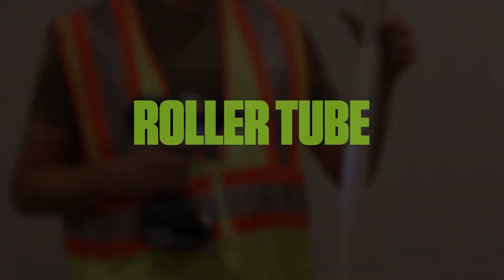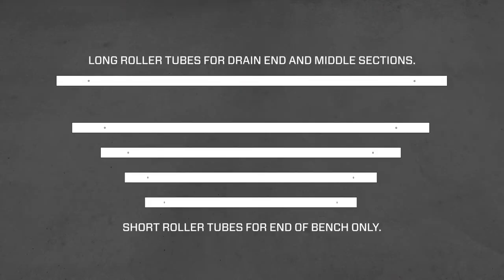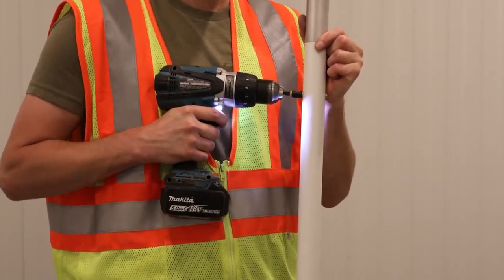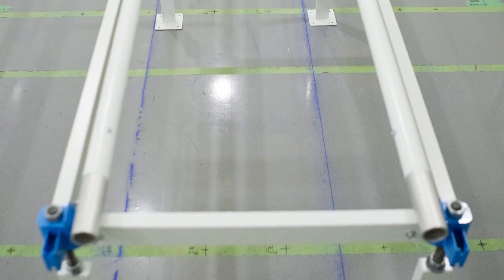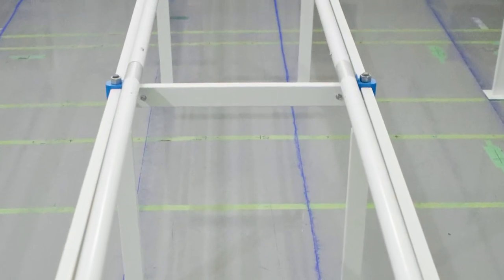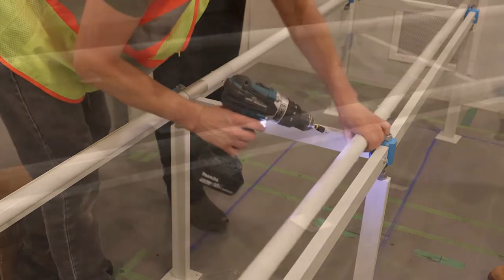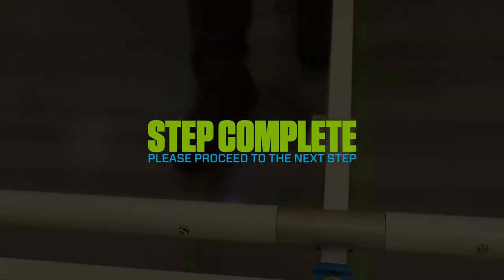Step 6: Roller tube assembly. There are two types of roller tubes: short and long. Separate the short tubes from the long tubes for easier assembly. Each short roller tube will receive one roller end, attached using hex head screws. Each long tube will receive a roller connector attached similarly via hex head screws. At the drain end, the long roller tube will receive a roller end attached via hex head screws. Do not over-tighten the screws as this will cause the threads to strip out in the rollers. When assembled correctly, the short roller tube will be over the last arch, away from the drain end. Center roller ends and connectors on each arch.